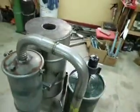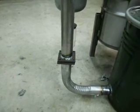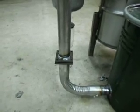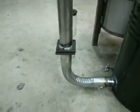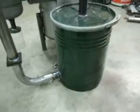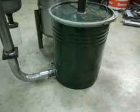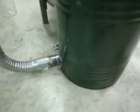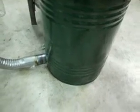Following the piping over — this is all two-inch automotive exhaust pipe — it runs down here. I built a flange out of quarter-inch, three-inch by three-inch flat bar, drilled four matching holes, and welded each side of the piping to that. There'll be a thin layer of orange high-temp RTV silicone there as well. Then it goes into the bottom of this drum, which is a little bigger than five gallons — probably about six gallons. The two-inch pipe extends through the bottom of that drum almost all the way to the other side, about seven-eighths of the way through.